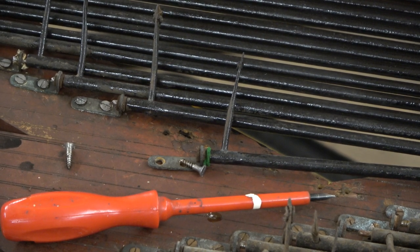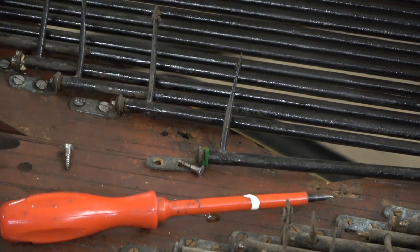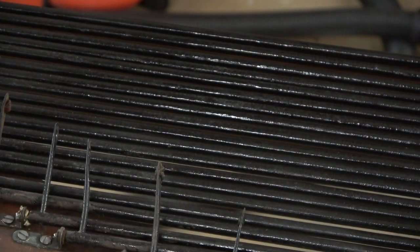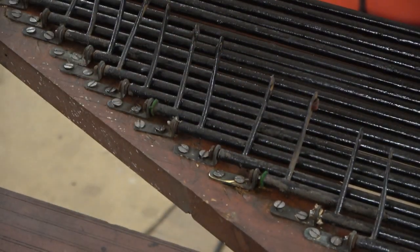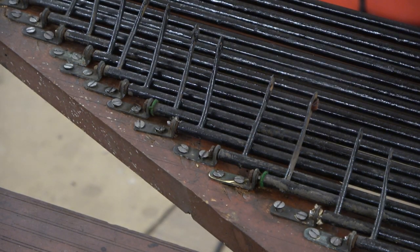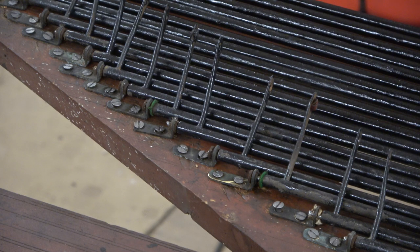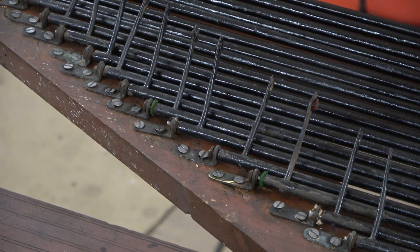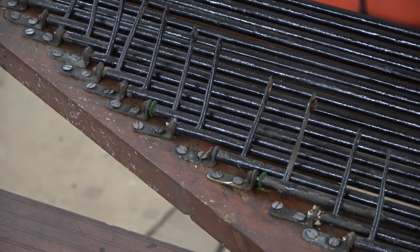So that's where we are. It's an awful lot of work to take these out and re-bush things. I'm going to show you how these are re-bushed, because all these need doing. It's easy to do them all in one operation — just put in the leather, go round with the bushing pliers, and I can probably do the whole lot in 20 minutes. Whereas if you take them out one at a time, you're putting tools down constantly. That was always good advice from Mr. Graves, my boss, when I was doing my apprenticeship. I'll do that and I'll see you on the next part.